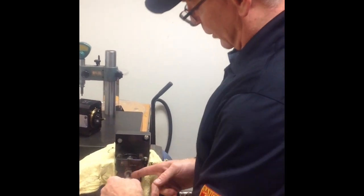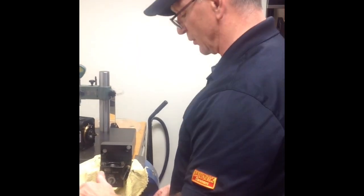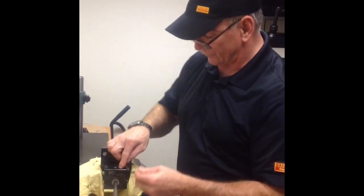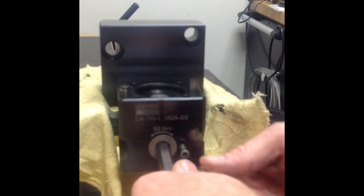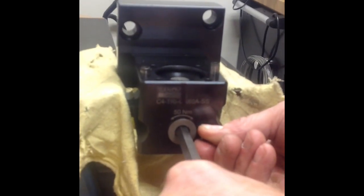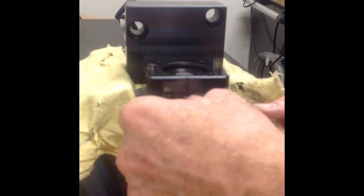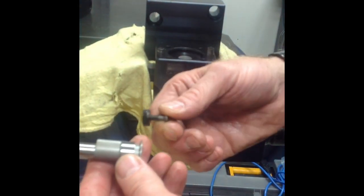Now I want to pull the camshaft out. If you put an allen key into the socket of a hex and pull on it, it's just going to slide right out. So there's a little trick here where I push down fairly hard with the palm of my hand on the allen key, and I'll take one of these screws from the polygon sleeve — they usually fit right into this retainer — and thread it in to give you a little handle, because we need to pull the retainer and the camshaft out together. Press down and give it a wiggle; at the same time use this little handle on the retainer and pull them out. The retainer came out and now the camshaft is free. You can actually see how the retainer has a little step that meshes with a groove on the camshaft, and that's what gives the camshaft 180 degree movement and controls that.